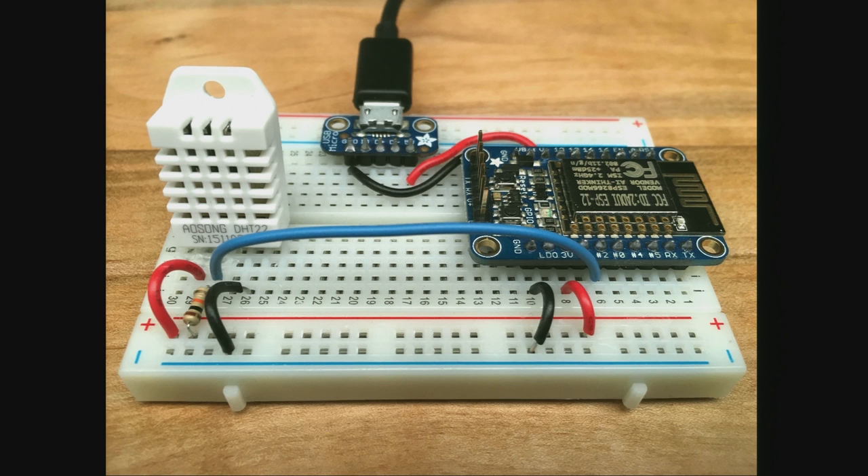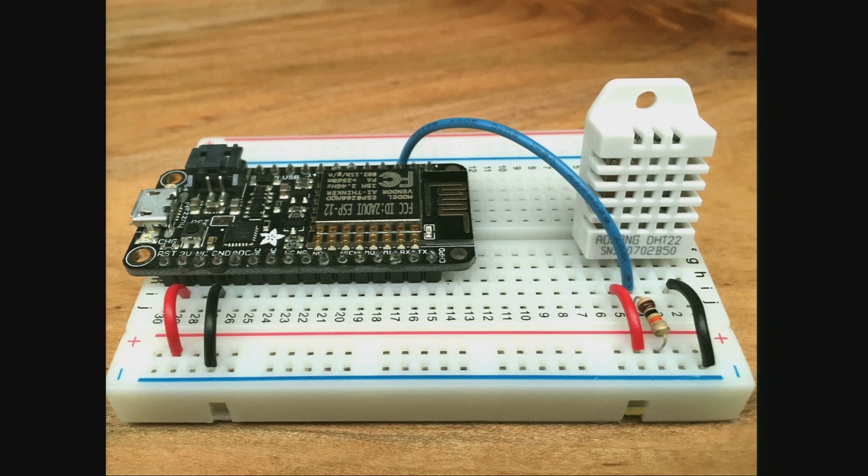There's another version of the same chip where you can plug a USB cord directly in, so you don't need a separate FTDI programmer. There's a connector on the side for a lithium-ion battery, and it charges lithium-ion batteries. These ESP8266 boards range from about $2.50 to $15 depending on the variant. For the humidity and temperature sensor, the boards run at 3V and the DHT22 can run at 3V or 5V, so you just run power, ground, and one data lead to a pin.